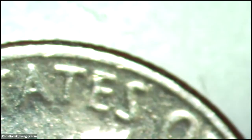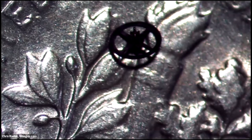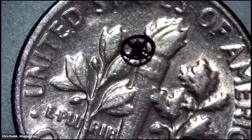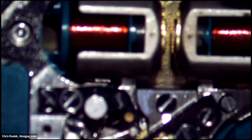I want to try to share the sense of awe I have about these and how revolutionary they were at the time. On my microscope here, I'm going to show you the standard U.S. dime as a size standard, and on it I'm going to set an index wheel. This is a bad one that I've got, so I'm not nervous about handling it. Usually you don't want to touch the edges of these because that thing has 320 teeth on it — and getting the vibrating tuning fork finger to advance that one tooth at a time, one tooth per vibration, was obviously a huge obstacle to making these things reliable.